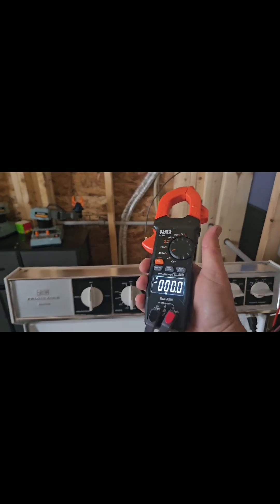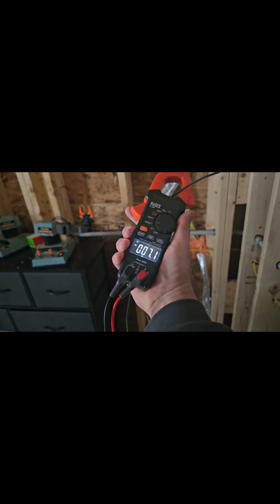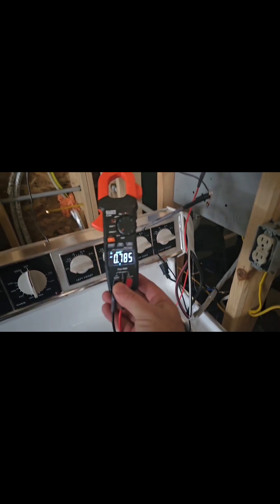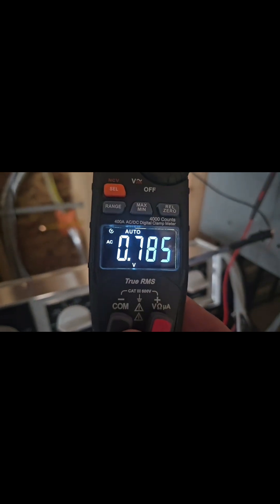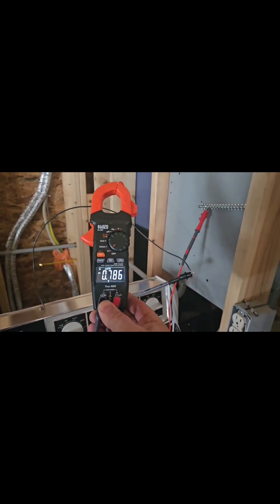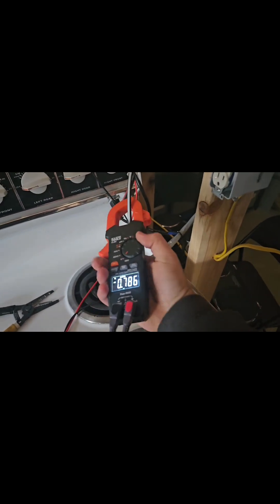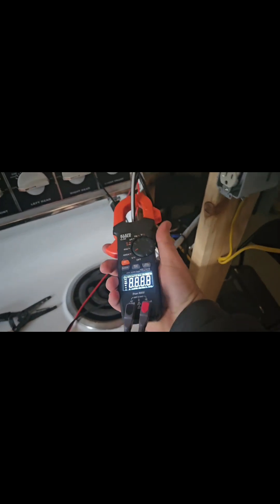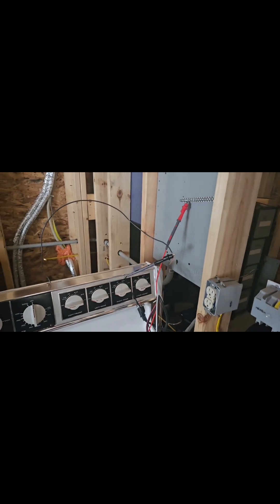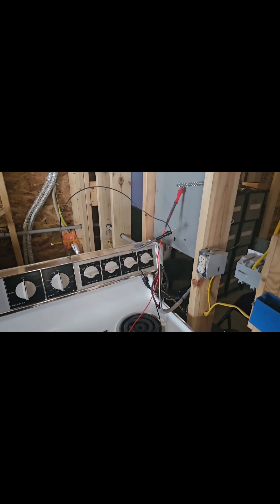The reason there's no shock hazard is the voltage difference between the two is very, very minimal. So we get seven amps on it. I have my leads connected to it. Now if we take a voltage reading between the two — so now our two leads are taking a voltage reading between the two — the voltage between the two points is 0.7 volts. That's why it won't shock you. 0.7 volts is enough to drive the imbalance across a very good connection, but not enough to send any of the imbalance through you because you have too much resistance.